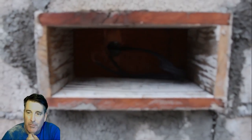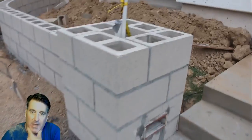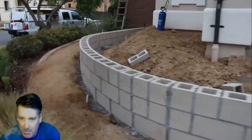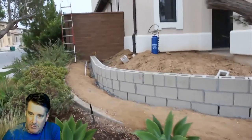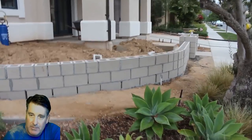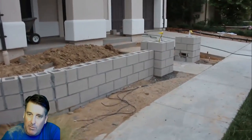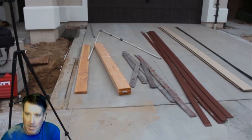Here's what it looks like when you're all done with the block and ready to start grouting it solid. Your next step would be to let that dry overnight. In this case, I'm going to be pouring the backyard with the pump, so I'll drag the hose around front and fill it up with the same mix I'm using on the patio. Instead of coming right to the top of the block, I'll leave it recessed about two inches so that when I pour the poured-in-place cap on top, it'll lock into the top block.